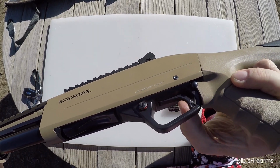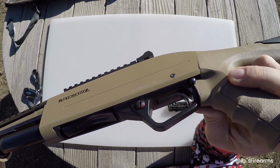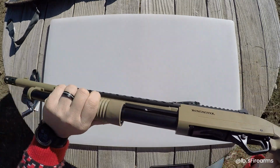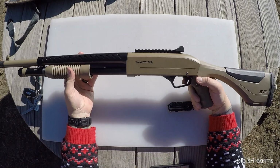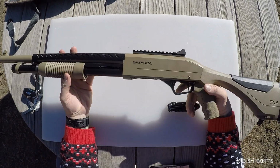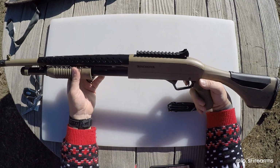And it kind of moved a little bit. Watch, when you pull the trigger, see how it reset a little bit? Just an eighth of an inch or so. But it wasn't doing that. Because it wasn't doing that, it wasn't locking the pump, which means it wasn't locking the bolt carrier group in there, which wasn't allowing the trigger to shoot. Basically, you thought it was out of battery, is my amateur assessment on what may have happened with this.